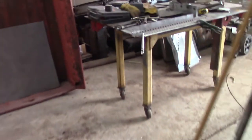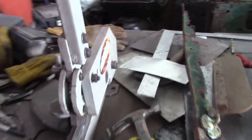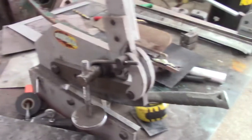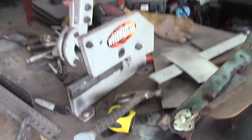A couple of tools I picked up — we went to Carlisle one year and got a special deal on some Woodward FAB tools. This throatless shear — this thing's awesome for just shearing metal, works real nice. You can put a whole sheet; we usually buy this stuff in 4x8 sheets. I've done it myself but it's a pain. With sawhorses and stuff I can lay it out, cut chunks out with this shear. It's very, very good — better than trying to do it with tin snips.